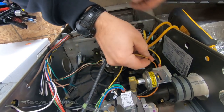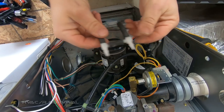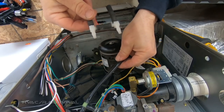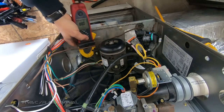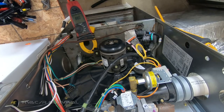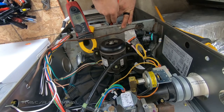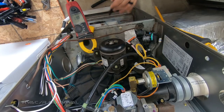Another reason to have this extra piece — some hoses are really big, some are small. It's really bad when you have multiple issues — multiple offenders as old Mr. Dave would say. The first thing I said was that thermostat was blinking funny, like it had some issues. Common to W — nothing. Common to G — I've got a call for G but no heat. So we need to go back and double-check the thermostat again. Sounds like we've got a bad thermostat and a pressure switch.